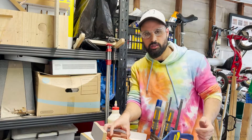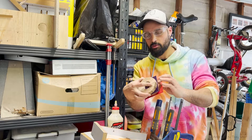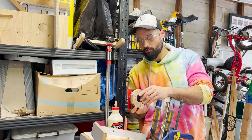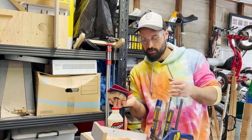What I've got going on here is gluing on the in-between veneer layer to the ring, and then they're going to stack up like that. I'll drill out all the holes to 41mm — that's what I worked out my segments to be. I probably should have glued these on before, but we'll make it work — it'll all come together.